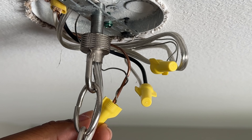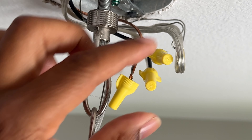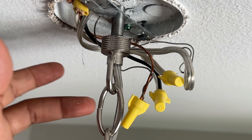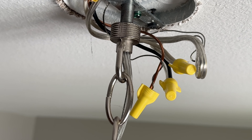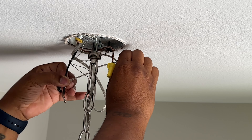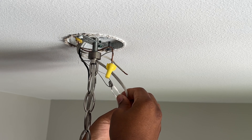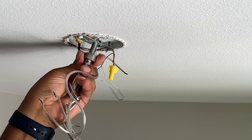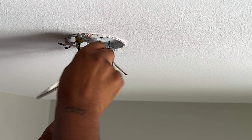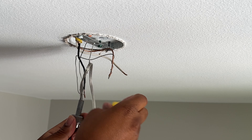You've got the ground here, you've got your black and your white wires. We're just going to undo these two caps right here, disconnect the wires that are connected to this lamp, take all of this off, then reconnect the ones we're putting up and that'll be that. Essentially you're taking the white and black wires — your live wires — and disconnecting them from the wires connected to the light fixture. You're also removing the ground wire so you can take this light fixture all the way off. After you disconnect the wires you're just running these wires back through the holes to completely remove the light fixture.